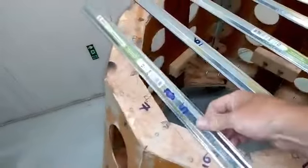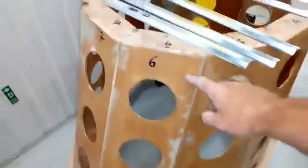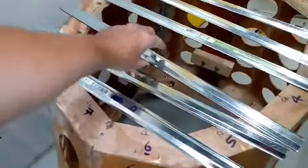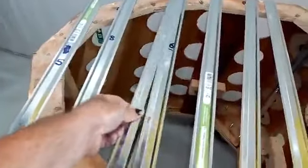So here's all my battens I've chopped up. I've had to number a bunch of them to correspond with the lengths of skirt panels. Each skirt panel is slightly different in shape. So, for example, panel 6 and panel 5 are different lengths, so you have to make the battens to correspond to the lengths as they go on the inside of the skirt. But I've realized that I only need to number 4 of these battens, just to go around the front 4 panels.